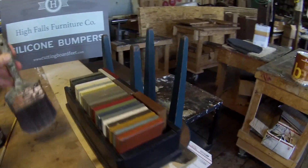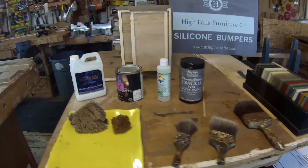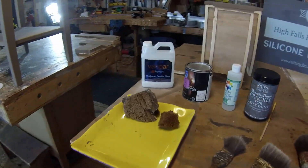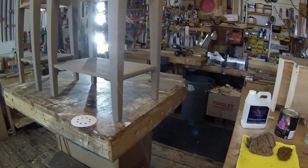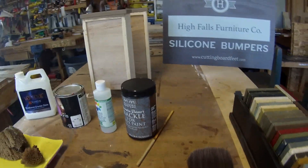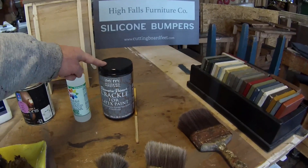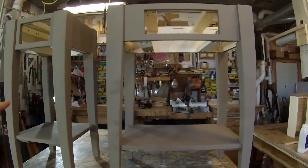You just want to dab certain areas and brush it to get a very thin layer. You don't want to make it too consistent — you actually want it to be varied, from thin to almost barely covered, so you get a variation in the crackle effect. The crackle is applied in such a thin coat that a bottle lasts a long time — I think this one lasted about three years. This one costs about $25 and the other was about eight or nine dollars.